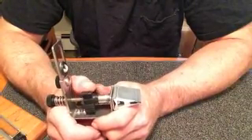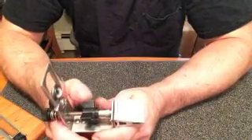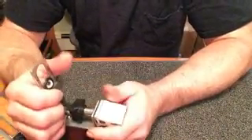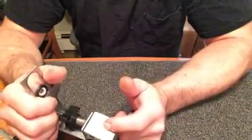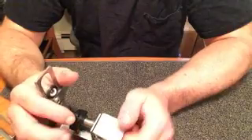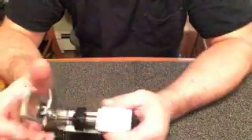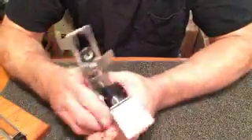It's a simple procedure, and if you do this with every knife you'll find excellent results. The procedure is: position — line up your knife how you want in the jaws; then pinch the jaws; then snug the clamp; then tighten the clamp. Let's demonstrate that on a few knives.